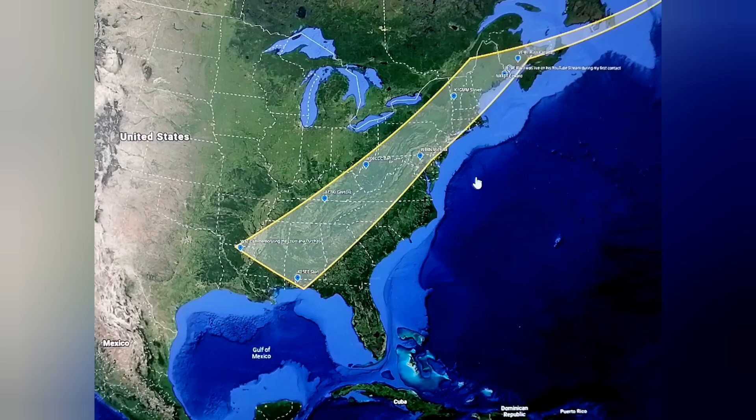The second map is again the home base delta loop at 10 watts, going across the Atlantic and getting into the northeastern tip of America and just into Canada as well. My 40 meter delta loop has some gain on the 20 meter band in the general direction of 288 degrees from my location. As you can see in this plot, I've achieved numerous contacts across northeastern America and Canada, even when conditions have not been brilliant. The salt water has played a massive part in allowing me to make these contacts.